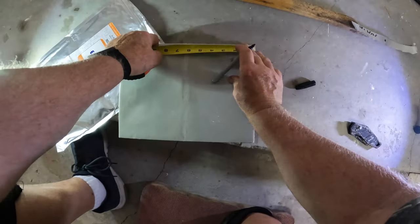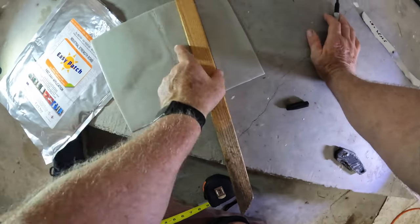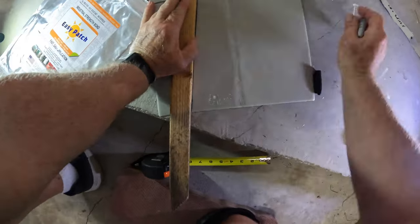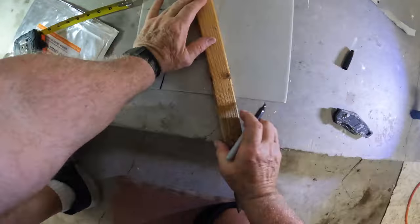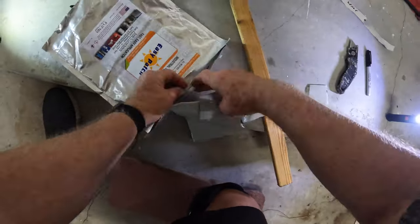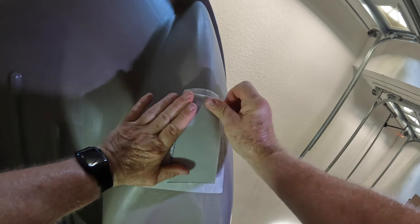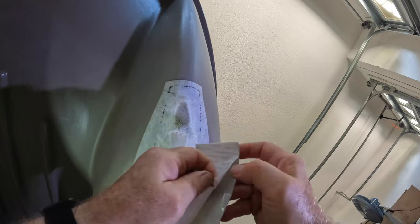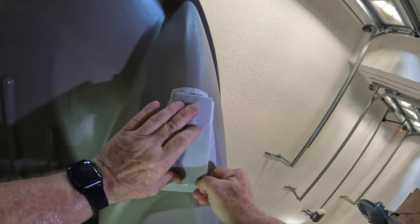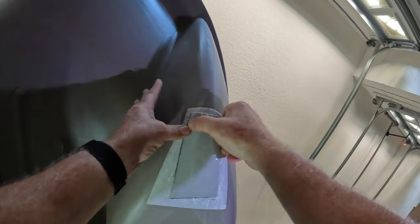I am taking the Easy Patch out of the package for the first time and the smell is a strong fiberglass smell — the exact same smell as when I open the Gator Patch envelope. I'm measuring it out, cutting all the pieces, and then putting back into the package what I don't use, because the UV activates it so quickly. On the port side, you have to take off a membrane on the bottom — I take off half, stick it roughly where I want, then peel from underneath to get it in the correct position. I did not have to cut out a pie-shaped piece like I did in the past — it squishes into place.